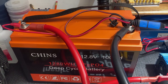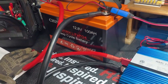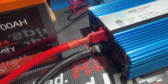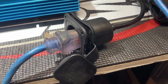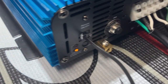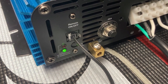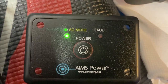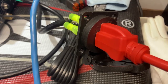I wanted to thoroughly test the system before building anything. I had a few questions regarding capacity and startup inrush. An inverter can pull a higher amount of amps when starting up than when running. My 100-amp-hour battery's BMS needs to be able to handle this inrush without tripping and resetting every time, as that would defeat the purpose of the instant transfer from grid power to battery power. Here I have the battery cabled into the inverter and I'm testing it on our downstairs coral frag system. On this Ames unit, the green light indicates the inverter is in pass-through mode, taking power directly from the grid.